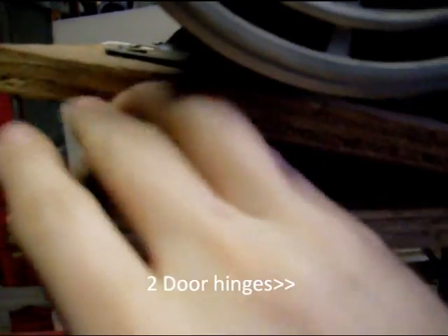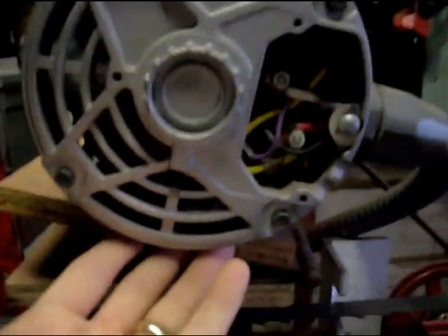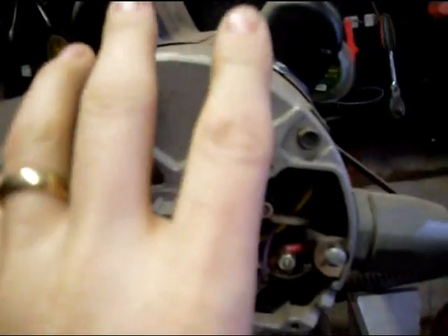This thing is set up on a hinge, so it uses its own weight pushing down to make tension on the belt. It's got plenty of play. When it kicks on, it immediately grabs and goes. The belt is half inch by 52 inches — it could be whatever, just pretty close. You can lift this motor up to loosen the belt, and you could get a slightly different size and it would just work, because it's self-tensioning.